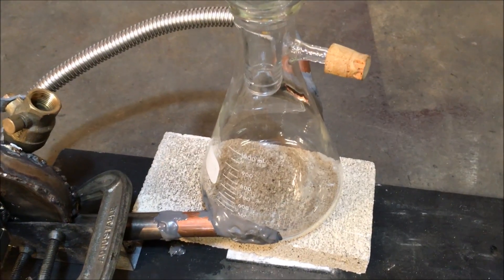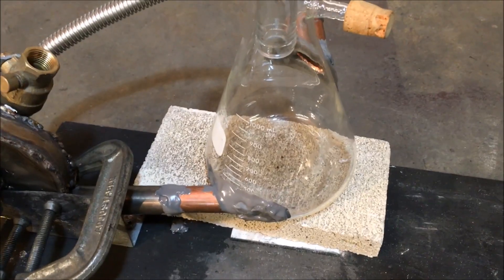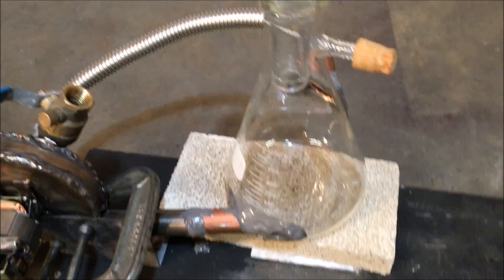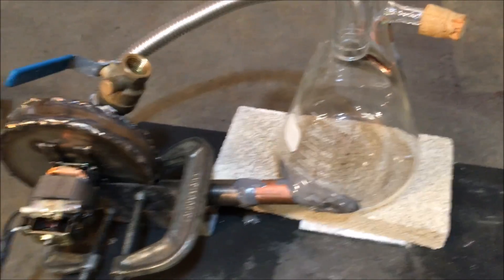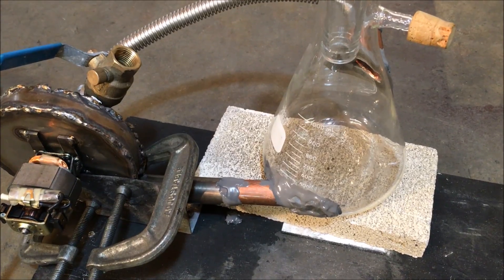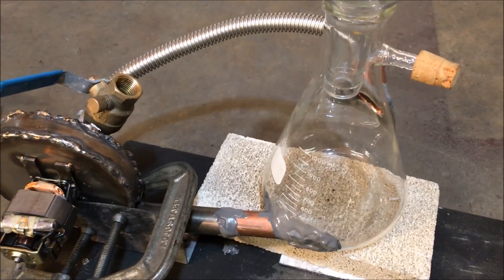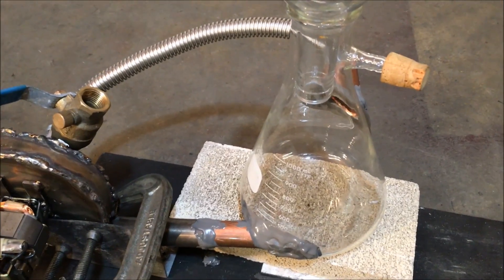The main purpose of this test is to determine whether or not we can come up with a device that can make fuel very efficiently using any size particle. This is similar to a fluidized bed operation but not quite the same. I'm thinking this will run a little bit better than a fluidized bed system because I don't need high-pressure air blowers and all that kind of jazz. This thing will basically run just like a fluidized bed system almost, in the sense that it will have a large surface area of high-temperature carbon, which is what we want to produce a lot of gas in a small space.